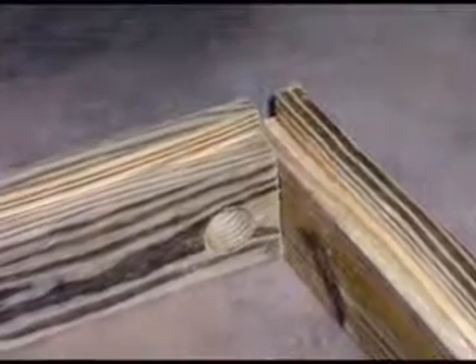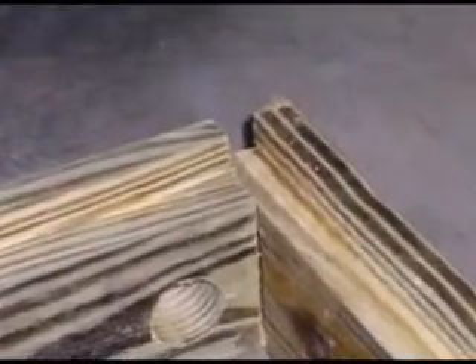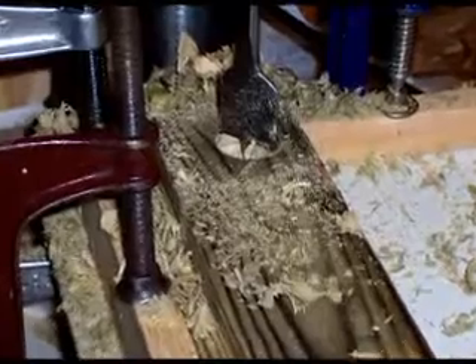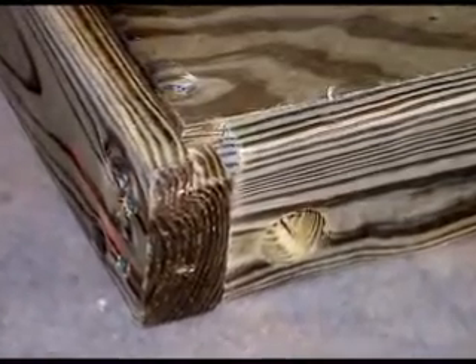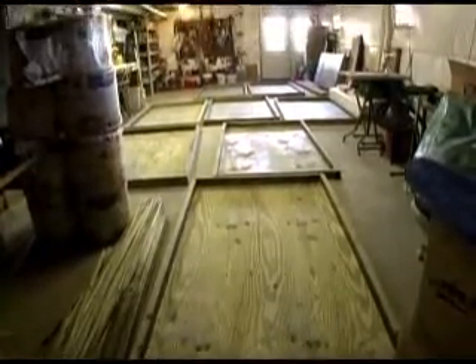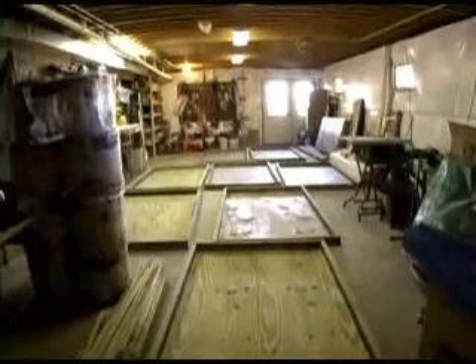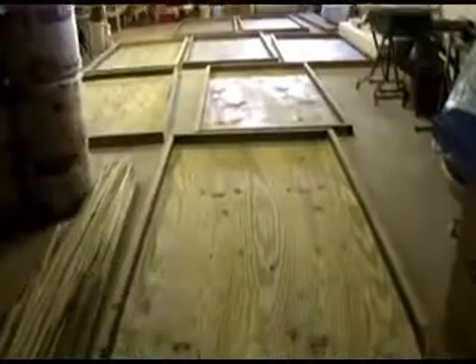I used Rustoleum high temperature paint without a primer and sprayed the face of these panels. I let the panels hang in the basement for about a month to let them off-gas before putting them into the boxes. For building the boxes, I cut a rabbet in the back of each pressure-treated 2x4, then drilled holes where the headers will exit the sides of the panels. I assembled the boxes with screws, including the plywood back, which fits into a rabbet in the back of the 2x4s. Each box also has three 2x2s running across the back of the panel to support the copper core solar panel and strengthen the plywood back.